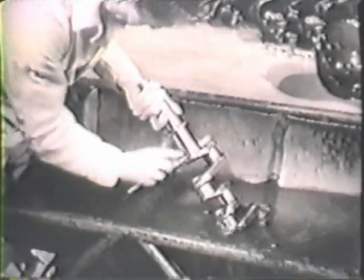With the engine torn down, your first job is to clean every last part thoroughly. Scrub all the smaller parts, like connecting rods, in a tub of cleaning solvent. Use a stiff brush to do a thorough job. When you finish cleaning the small parts, dunk the crankshaft in the solvent. A brush will help you clean in around the throws, journals, and bearing surfaces.